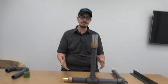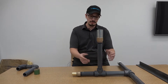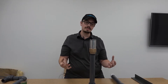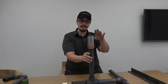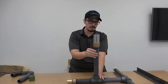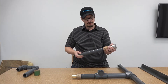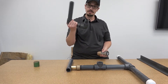Let's talk a little about stand pipe height and customization. Every application has different depths of water — in some instances you may not have a ton of depth, so you need to modify this to get the intake farther from the surface so you're not sucking air into the pump. Sucking air causes you to lose prime, and if you don't have a low pressure cutoff switch or motor protection, the pump will inevitably burn up. This is the standard stand pipe — about a 12-inch nipple — and here's another lower-profile option.